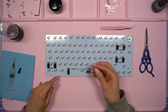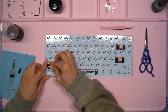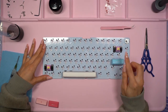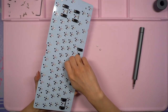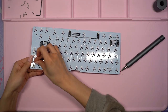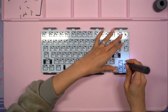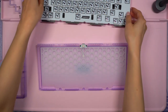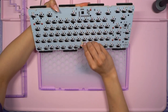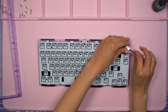I inserted four switches and added four keycaps so that I can test out how the stabs feel, and from here I can adjust as needed. Once I'm happy with it I just remove them. The PCB is basically ready for the switches but it needs to go back into the case first. I re-added all the standoffs, placed the felt mat back on, then the plate, and screwed everything back into place. I brought the case onto the work mat, opened it up, and hooked the PCB back up with the daughterboard. I carefully laid the PCB on top, reinstalled the rotary knob securing that as well, placed the top of the case back on, flipped the keyboard over, and closed everything up with my WowStick.